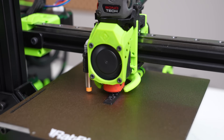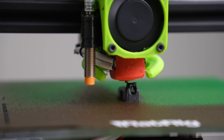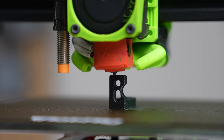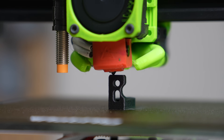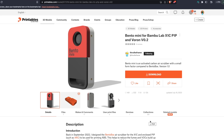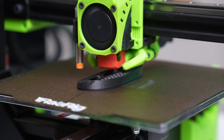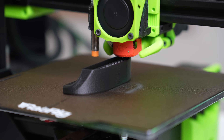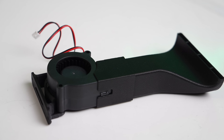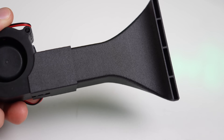I started with a small test print of a BL Touch holder, which looked great until the top, where no layer cooling fan or minimum layer time caused the layers to sag. I tested both fan settings and printing two at a time to give more cooling time, with similar results. Moving on to larger parts, I printed all the pieces for a bento box mini carbon filter and a GULL static cooling fan for my V0.2. I was blown away with how well this filament printed — zero stringing, no warping, and very consistent layers.